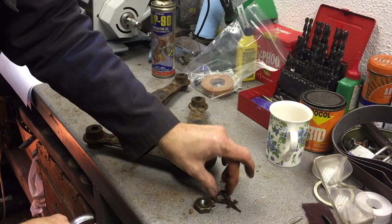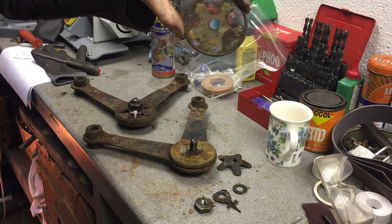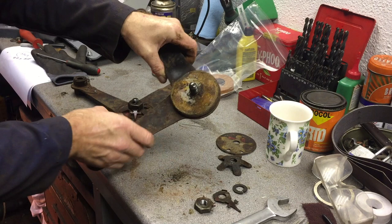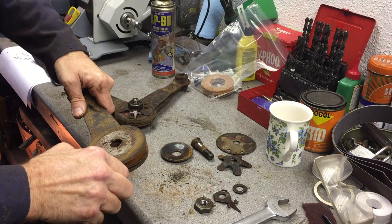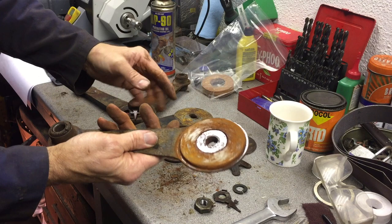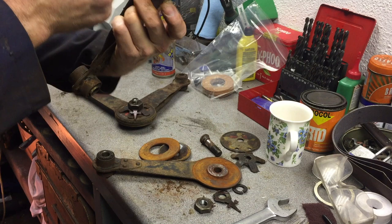Success. So you've got your tension indicator spring washer and then your tension spring, your adjustment indicator disc, your tension bolt back washer, and then the friction arms and your friction discs. As you can see, it's rusted up rather than generating friction and has basically just locked up.